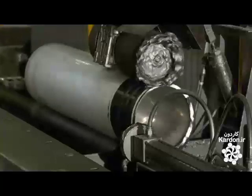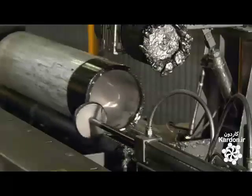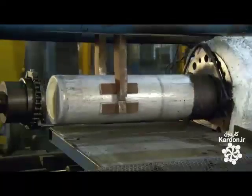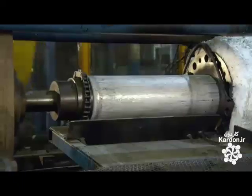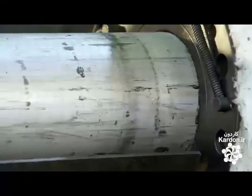The freshly formed cylinder now spins as a roller applies a lubricant to the open end. The machine ejects the cylinder. Then it's over to the hydraulic neck press. This press forces the opening of the tank into a die to narrow it substantially. This establishes the basic shape of the scuba tank neck.